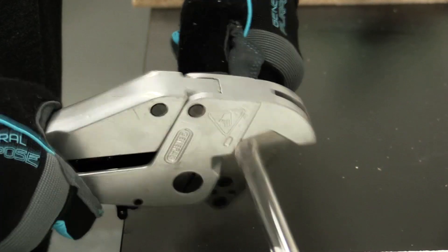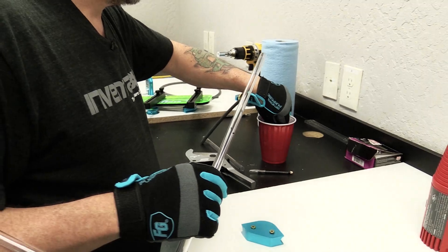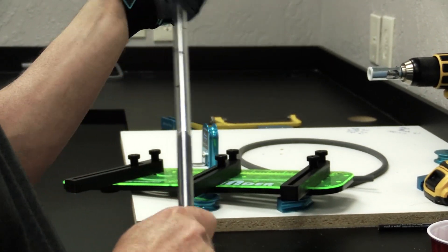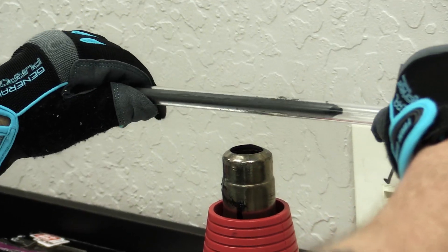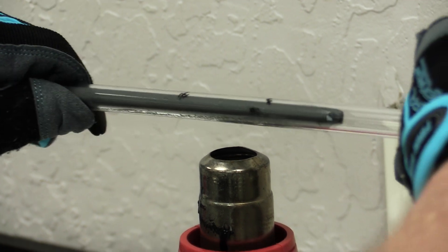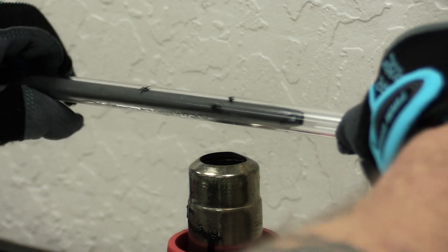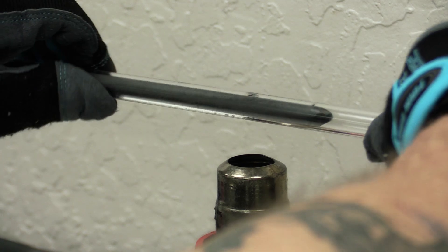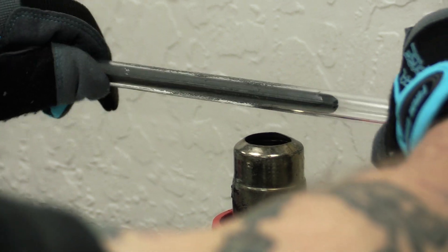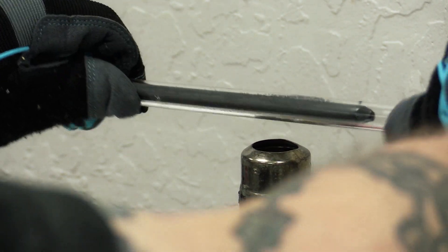We'll take out the rod, trim this side — nice clean cut. A little more lube. Sometimes it's better without the glove on this part so you can get some friction to push the bending rod all the way past our bending points. Apply nice even heat distribution over that entire area, which should produce a nice clean bend. Since we use an eyeliner pencil or grease pencil we can clean up those black marks and the tube will be nice and clean. If you're patient you'll have a much better result. Make sure we have even heat distribution over the entire area so we have a nice smooth bend — we don't want it to kink.